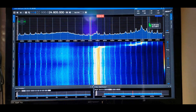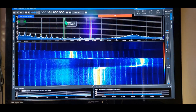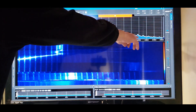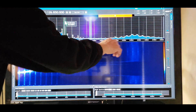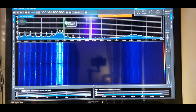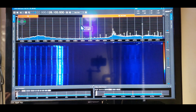Let's bring the band over some more and see where she stops. Here's where 12 meters was — going up in band. There's 11 meters, CB range — let's see if we can get in there. She's going! But runs out right there. You can see where the back side of the capacitor is coming in around there. The capacitor is opening up as I turn it, then bringing them together. You might be resonant on CB, though not many people talk on CB out here.